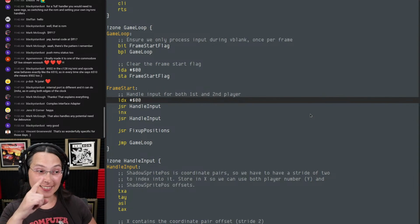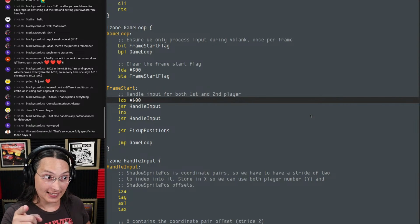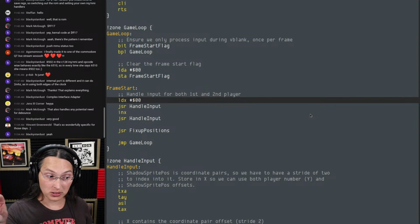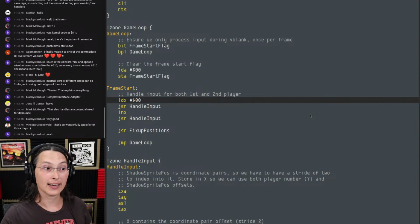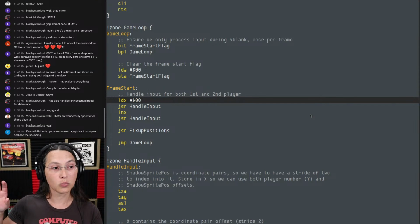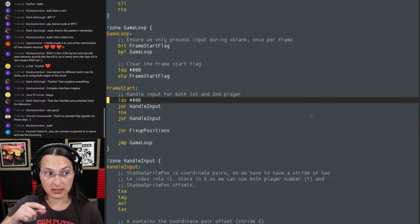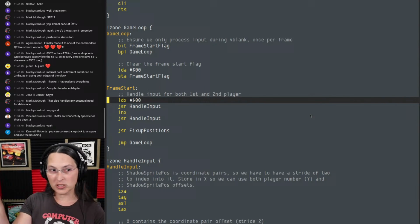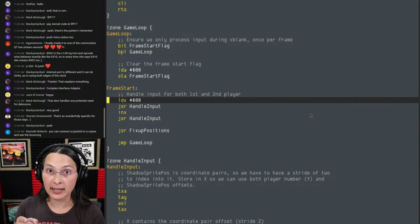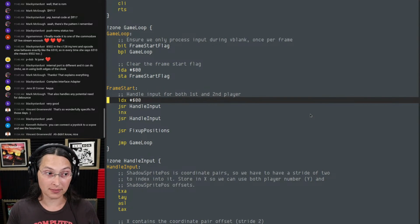I know, but the thing is, actually, Vincent, so you're saying those days, but this is still true today. So when you're dealing with inputs on, say, a Raspberry Pi, the Raspberry Pi's GPIOs are also not debounced. So you have to deal with that. Same thing is true on, say, like an Arduino. All of the GPIOs are raw. So when you write your Arduino code, you still have to go in there and have a routine to debounce all those switches. There's a whole bunch of algorithms that are specific for this, and there's a million different ways of doing it. There's also ways of solving this in hardware, but in general, solving it in hardware is expensive. So most of the time, we just do it in software.